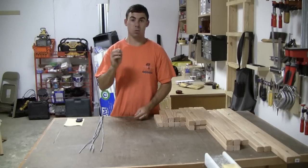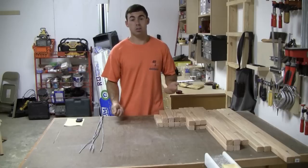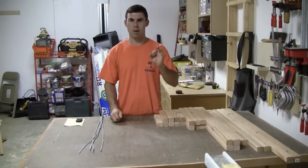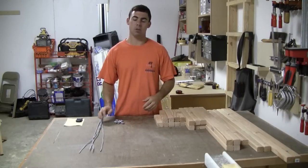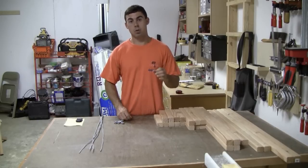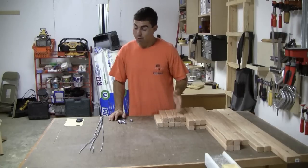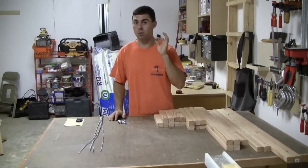I like to use 1/8 inch wire clamps to hold everything together. You could also use staples, all-thread rod, or little round ferrules that you clamp on the end of the wire. I tried staples — they suck. I bought some little crimping clamps and I couldn't get them to clamp hard enough and hold. I didn't want to deal with all-thread rods, so I use these wire clamps and they hold awesome.